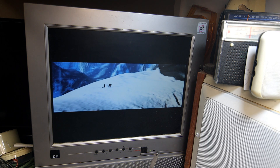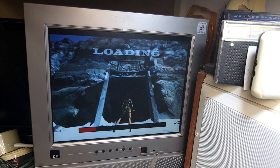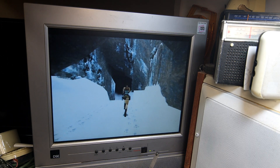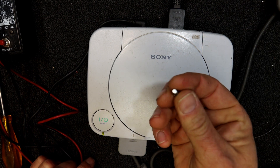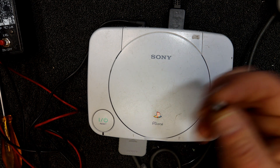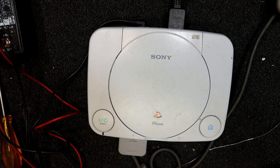The other one seems to work when I heat it up, so I suspect that's got faulty caps as well. I changed the laser in it, which at least fixed the broken platter part, but it's still got issues reading. When it's cold weather, which it is at the moment, it wouldn't even read the disc at all. I guess the next project will be to actually get some capacitors - get all the different values of these surface mount things - and give this thing a complete recap. I think I'll do the same with the other one and see if it cures that one of its issues. We'll go from there.